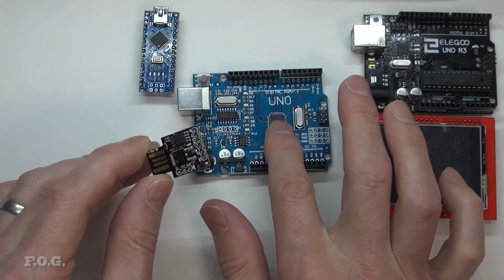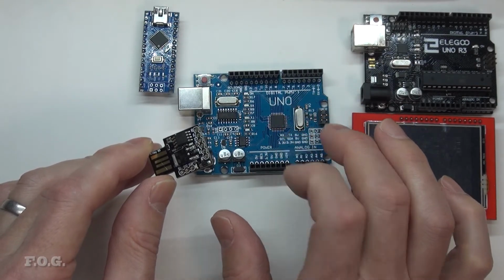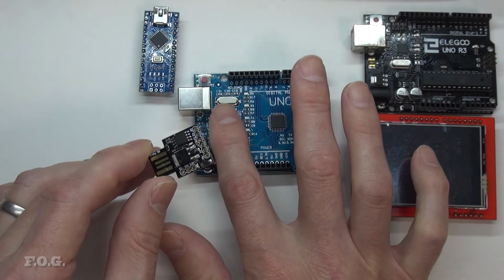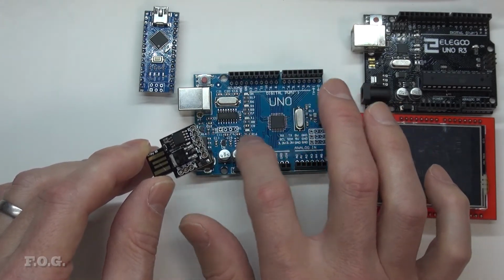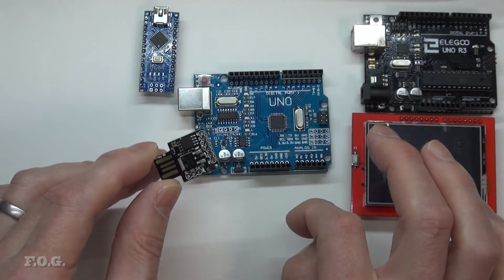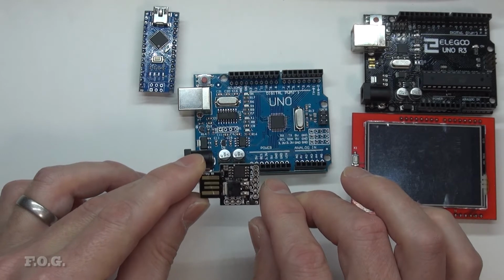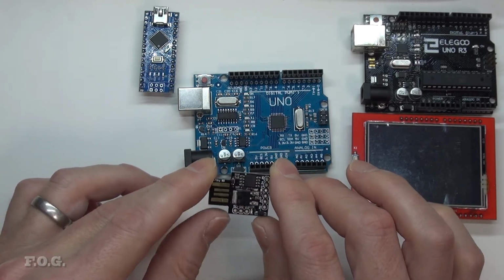When the Uno boots up, it checks pretty quickly, and it kicks off the bootloader and gets into the program relatively quickly. It's not that big a delay, and once it's booted up as well, it then can use the communications device here to establish a serial transmission and reception to the computer as well. So you can get on a terminal and send and receive commands to the processor through this communication path. But here, obviously, that doesn't work that way at all. There's no communications path naturally established, so it has to be programmatically, and so therefore it's not practical.